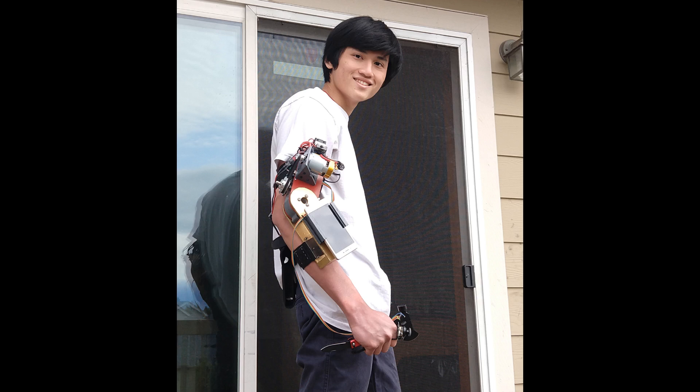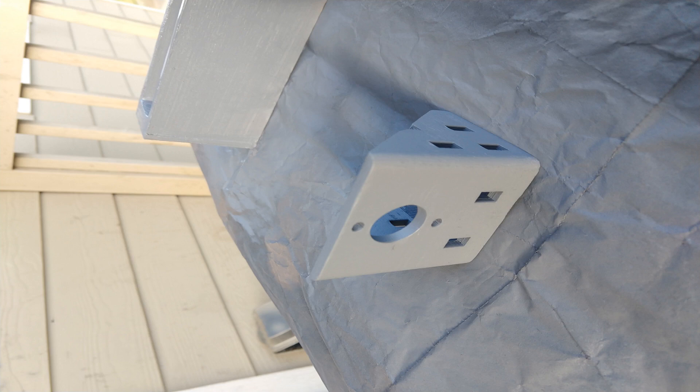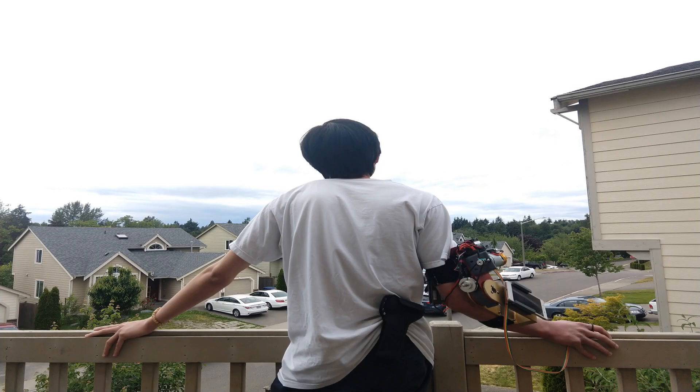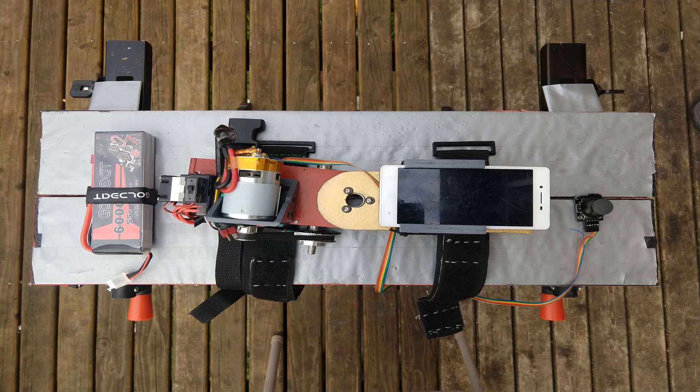Here's some comparison to the first Bionic Arm project, which also shows the potential and capability of the arm. The Mach 3 is more efficient, easy to put on, faster to assemble, handles more load, and has more power — up to 200W. It has more capability and empty space for upgrades, is easier to control and more responsive, requires no end-stop, runs on battery power instead of wall power, and is non-back-drivable for load carrying without consuming energy. It also features a modular solution, with Bluetooth and Wi-Fi integrated, and the motor can be easily swapped out and upgraded.